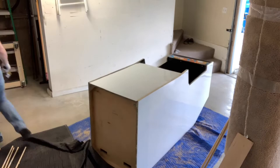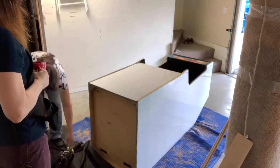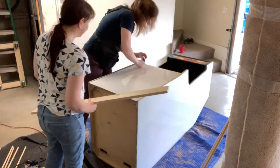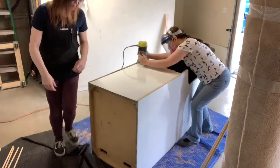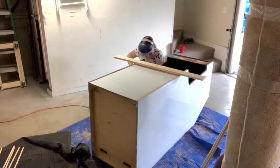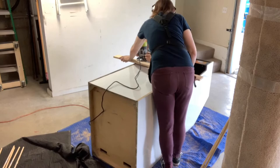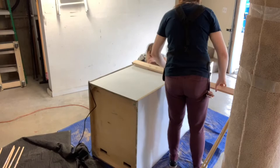We were able to pop it in but it cracked a tiny bit on the very bottom — I don't think anyone will see it. The lesson here is it's better to be a tiny bit smaller rather than trying to be exactly on the line. The lip on this cabinet created a little more challenge for the router, so we had to build it up with some wood blocking. If you've got a weird cabinet this becomes problematic. In a perfect world you might disassemble the cabinet first, though that creates its own problems. Many cabinets are flush on the front so you may not run into this issue.